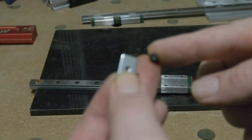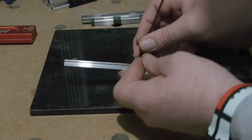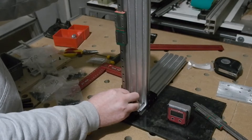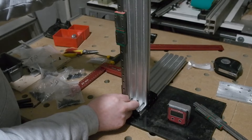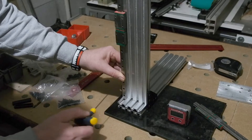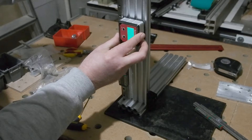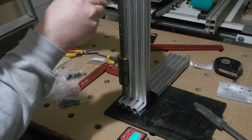The linear rails are attached with bolts and sliding T-nuts too - this time tiny M3 ones. The rails are counterbored to hide the bolt head, so it's handy to hold it in place with an Allen key while screwing on the T-nut. With the first rail on, I position the bottom of it central to the slot and lightly tighten the bottom screw. With that as a pivot point I zero the level box to the base and set the first rail at 90 degrees, tightening bolts from the top down while checking as I go.